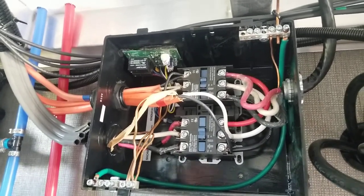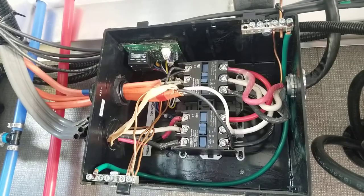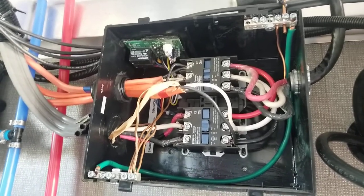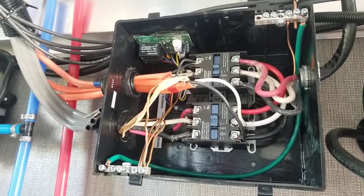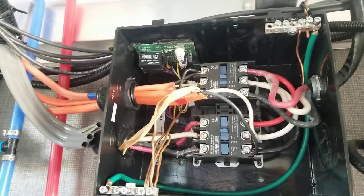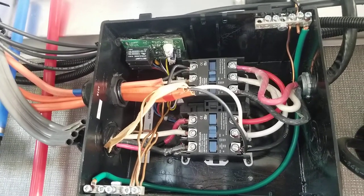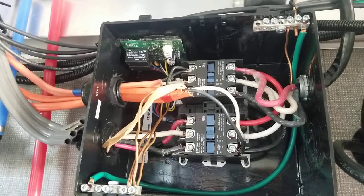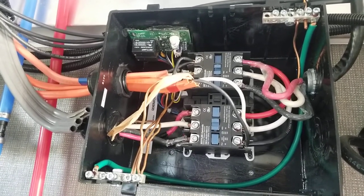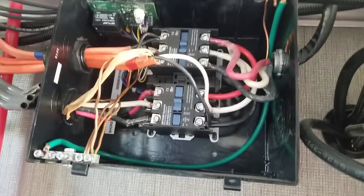Now, once you turn the inverters on, this is going to take priority, and after 1 minute, it's going to automatically switch back on, and I have video of that happening that I took yesterday. So that means that the generator can be running or not running independently. With the inverters kept in the on position, which they should always be, the power is always going to be applying, and if the generator is running, that's just going to be fueling the devices inside, plus putting a fixed amount of power into the battery that is selectable by option number 11, which is the only option that we really have to change on this system.